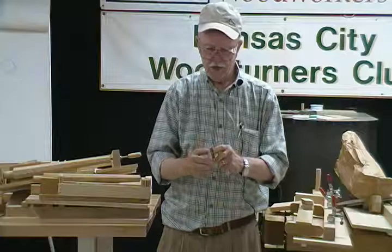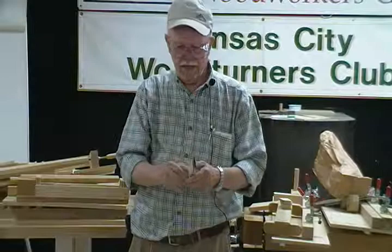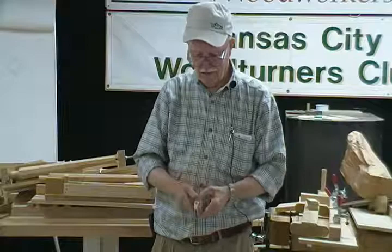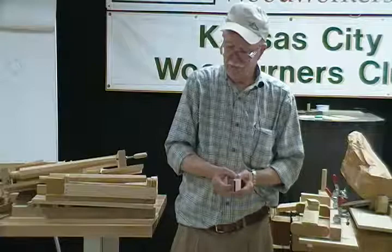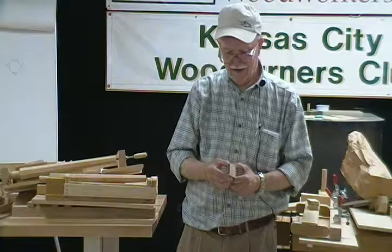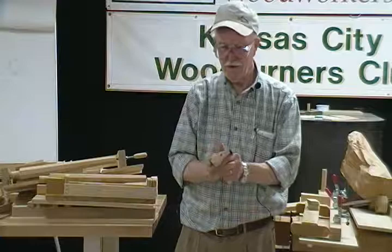So you want to make your little scraper block like this — we'll make it three inches, assuming your hand is the same size as mine, but you can make it any length you want. Let's analyze what we want to do. We want to take a three-inch piece of wood and drill a hole in it on the center. We can get on the drill press with a stop block and drill this hole. Then we want to make a slot cut right there on the bandsaw — that's kind of tedious running that up to the bandsaw, and it violates the three-inch rule. And what if it slips or steers? That's not good. After you get that slot cut, you want to establish a taper here to clear the blade, then smooth that over.